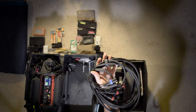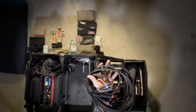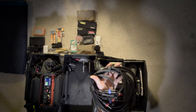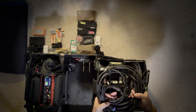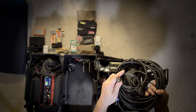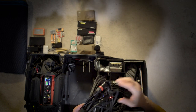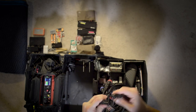This is a breakout cable for any audio mixer — not necessarily the 633 specifically, but you can use this on any of the Sound Devices mixers. Basically it's got two male and two female XLRs and a headphone return, so I can feed two channels of audio into the camera and then plug the cable into the camera's headphone jack to monitor that feed back at my mixer — listening to what the camera is recording. It also has a little female jack so I can listen to what the camera is hearing while the camera operator still uses his headphones. It also comes with a quick release so you don't have to constantly plug it in and out of the camera every time.